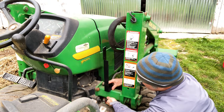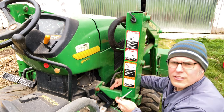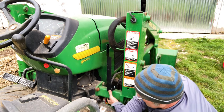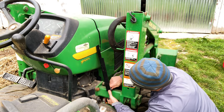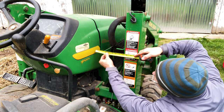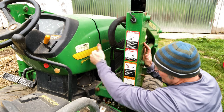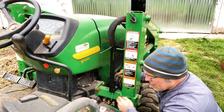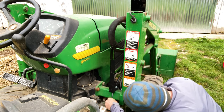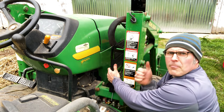There's limited room underneath this bar. I'm going to take my two bolts, slide them through this backer plate, work that up from underneath this support arm, and then through the bracket. As you get this situated, we need to make sure we've got enough room on the inside for this valve — it's about four inches thick. So I just want to make sure I've got at least four inches of room and this bracket isn't hitting this outside support. I've got my lock washer and nut on top of this bracket. Now I tighten it up with a half-inch wrench. That feels solid. Good to go.